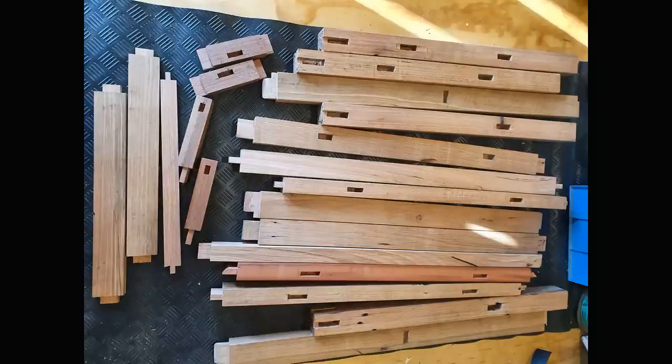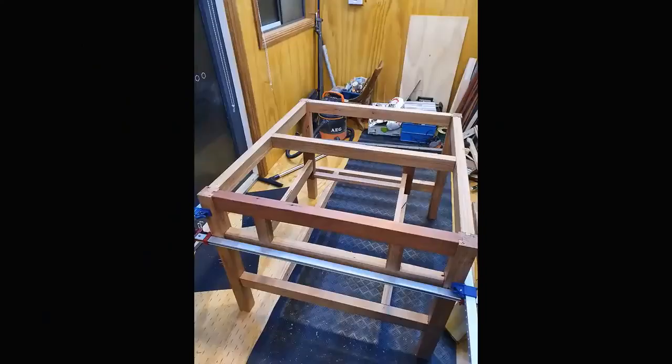The timber for my table is hardwood obtained from a demolition of the house across from where I live. I think it's tallow wood. As it was rough sawn, I ran it through my thicknesser to clean it up. The entire frame is joined using hand-cut mortise and tenon joints, 30 in all, including the suspended drawer frame, the 4 top corners of the top frame having haunch tenons, which are also mounted on the ends where they meet with the leg. See pic 1 ready for the glue up and pic 2 for the frame assembled.